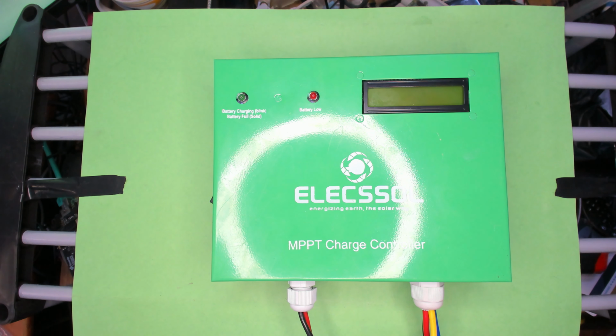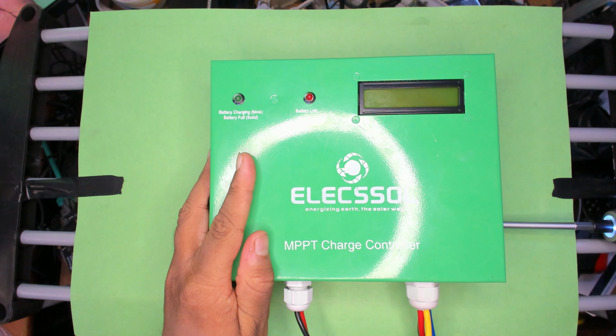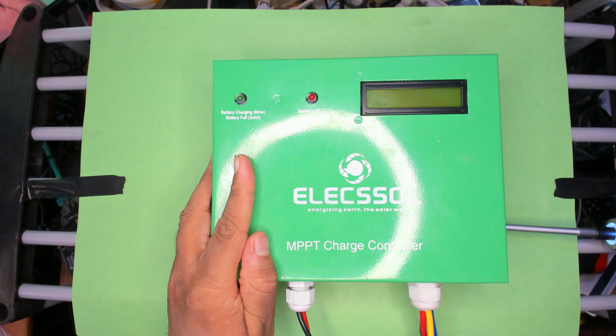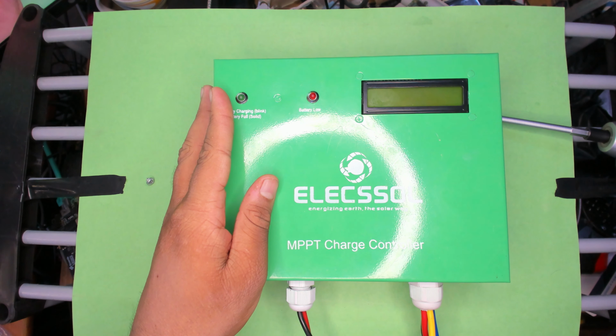In a chemical charge system, if you have a battery charged to say 20 volts or more and another battery that's at 17 volts, the overall voltage in the circuit will drop to 17 volts, but you have an increase of current because it's inversely proportional. Now in a solar panel that doesn't happen. You don't have an increase of current, you just have the drop in voltage and the current drops accordingly. So it's actually generating way less power than you would hope for, and you don't get the full efficiency of your solar panels, and that's why we use MPPT.